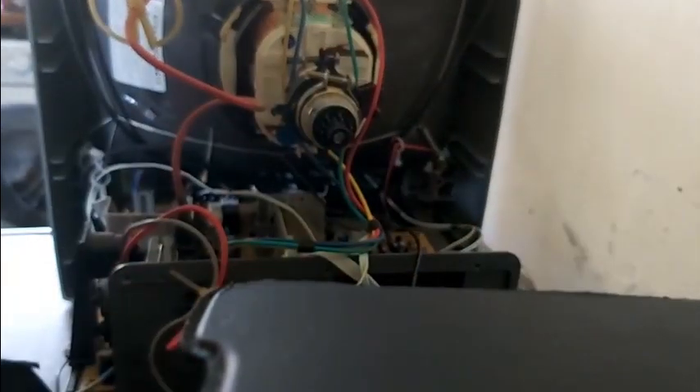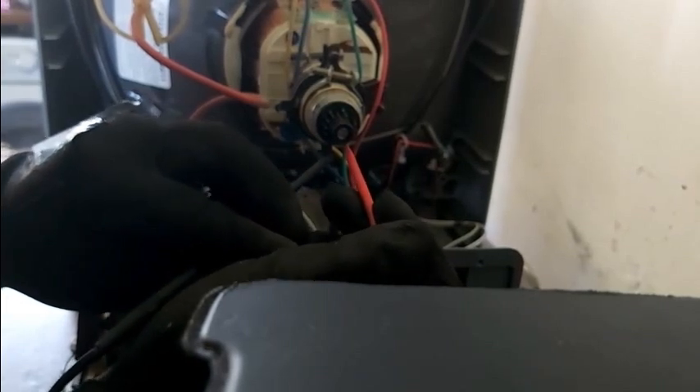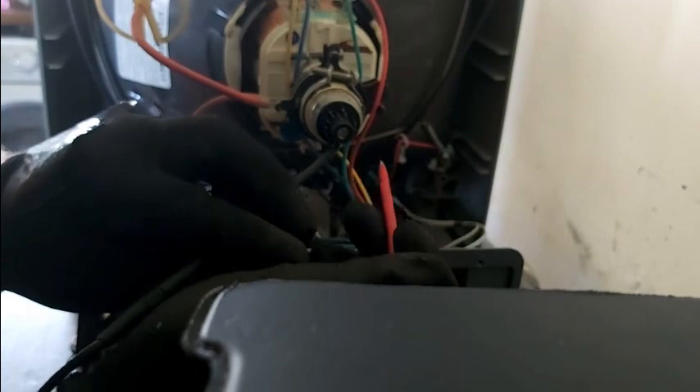I can kind of get something there but it's just starting to come off a little bit. It's a TV from 2005, not from the 1950s. We've got slightly better, but all you need is a multimeter with a continuity test. Usually the heater pins are two together, and if we just keep checking - yep, there you go, it's these two here.